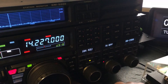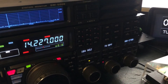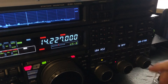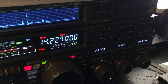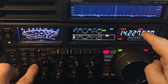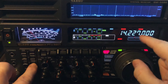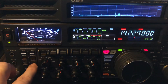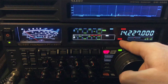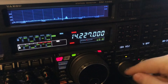I keep menu 104 as the one I'm always on. I'll come over here and rock it up — sometimes 200 to 2800 works, but sometimes I'll go to 300 to 2700 to narrow it even more, and in her case I had to do that. To kick in the accentuated 900 Hz and 2400 Hz, I go from my normal rag-chew setting — plain EQ — to processor EQ. When I'm done and want to go back to rag chew, just back to the one light. Always check that, because the 5000 sounds terrible without some EQ. Then I move the bandwidth back down to 100 to 2900 and escape out.